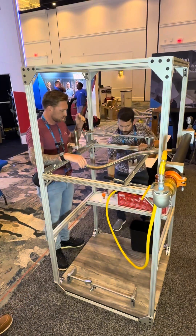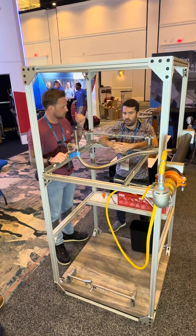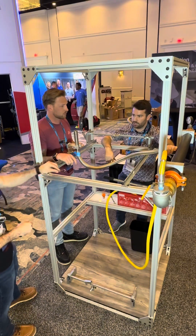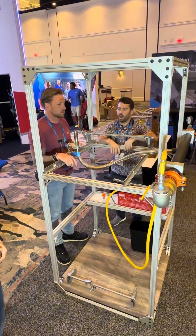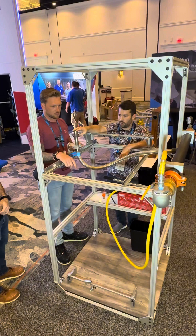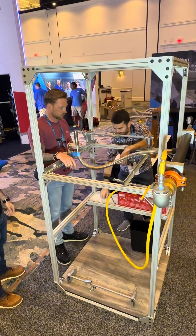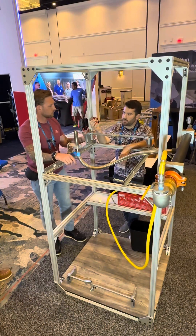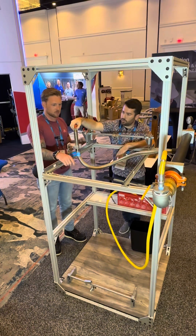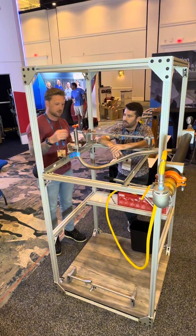Now you have a Flex Rapid Seal? We do. ASC has historically partnered with Viking, and Viking has come out with a new technology called InstaSeal. You've probably already seen it on the 1-inch NPT outlets or InstaSeal outlets, but we've also started the exploration of including it on our FlexHead SuperFlex offering over here. This is actually an InstaSeal outlet on our SuperFlex line. You're going to be able to take this — it's a standard half-inch, I think it's a 5-6 sprinkler — and install it. You can actually do this yourself if you would like.